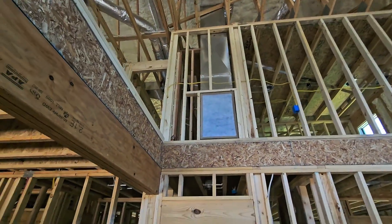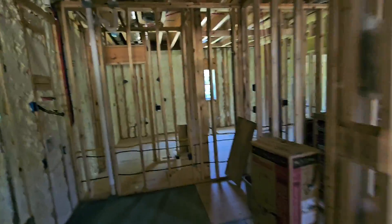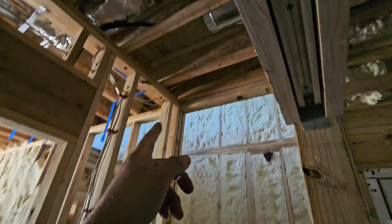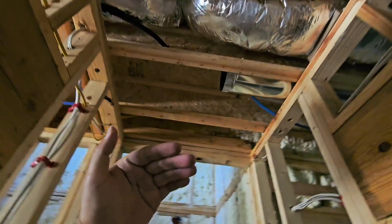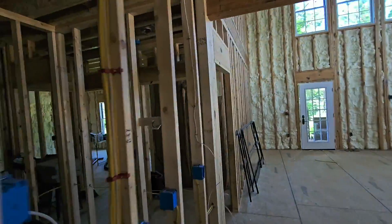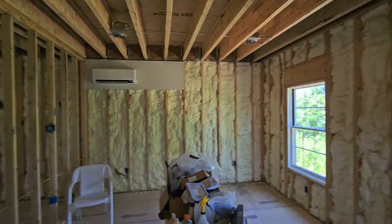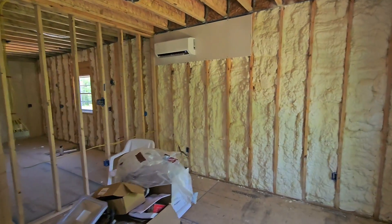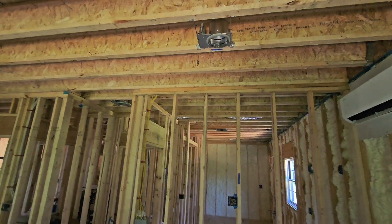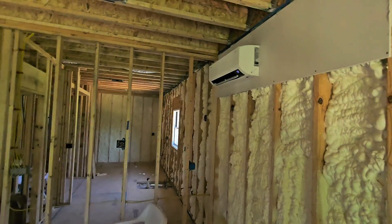The reason we did not install a four ton unit is because there's no good way to get the vents from the master bedroom area through those trusses and into the first floor. How do you get those vents all the way through those trusses into that area? There's not a good way to do that. Easy solution: we've got another unit specifically for the master bedroom. Nobody wants to cut a hole through all those trusses, and it wouldn't be a good idea. Plus, with two units, we've got more redundancy.